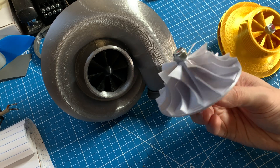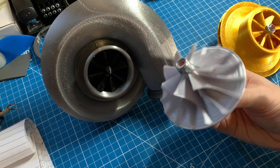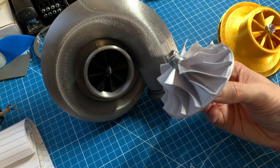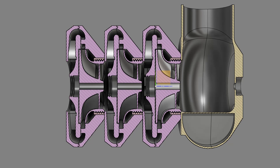My hope is that this higher pressure ratio allows me to spin at something like 15,000 RPM and that this wheel would actually produce some pressure. An over-engineered tire inflator is kind of my best-case scenario. Based on my research, even getting 30 PSI of pressure was most likely going to require multiple stages unless I wanted to spin it at 100,000-plus RPM. I was also concerned about the compressor wheels exploding at 100,000 RPM and throwing shrapnel in my face.